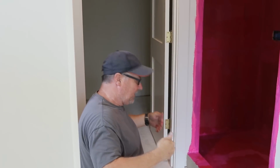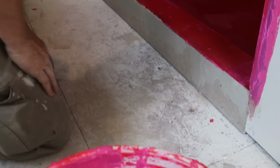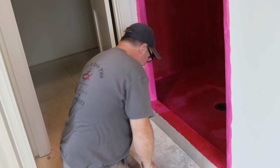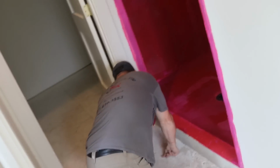Hold the mud up. Then you put your mud in there and you put lime in it to make it sticky. And when they float the walls, they didn't have thin set. So they'd set the tile right on the float job, and they would just cast dry cement on the wet mud, and then put the tile in there and just beat your tile flat into the mud. Whoa. And then it just dried that way. Yeah, it was a totally different process.